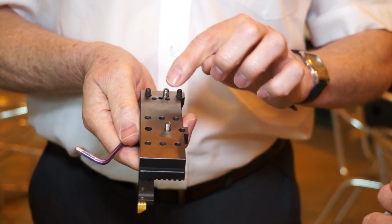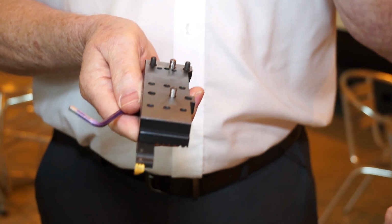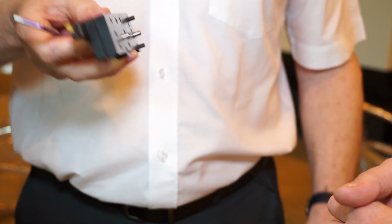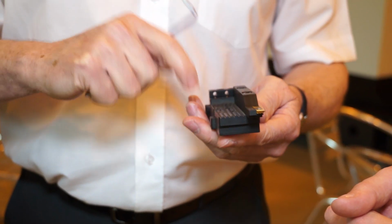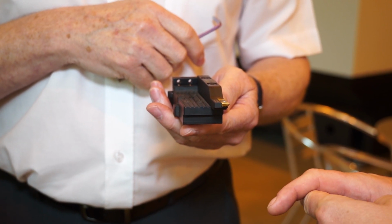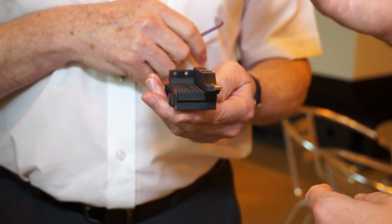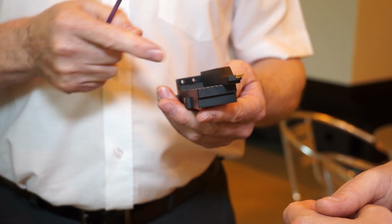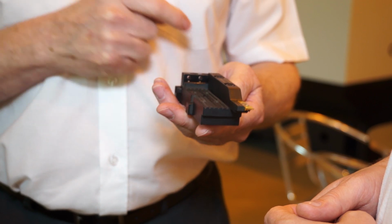This is the location position for the machine, doweled in exactly the same position as the Nano, so it just goes straight on and is secured with the bolts, as you would with a standard platen. So the tool holders are very quick to change, but also, I know you wouldn't take it on and off, but when you're going from the base plate and normal if you needed to, it's very simple. Yeah, it's just the same fixing as Tornos shoes with the clamping screws.